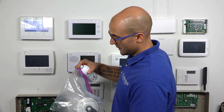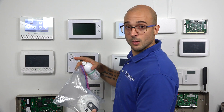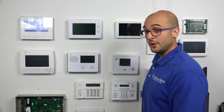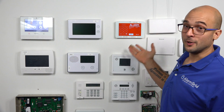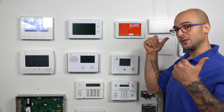If you have two people to help you do this, it's much easier. CO in the bag, and I'm going to seal it up so you have a closed environment. This can take some time for the detector to go off, so after you spray the CO in the bag, set it down and just leave it until it actually triggers. And we got the alarm. So our test did work, and it confirms that our CO detector will detect CO in an environment and trigger an alarm at our panel, which is great.